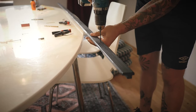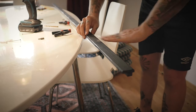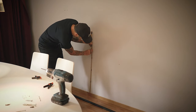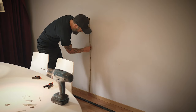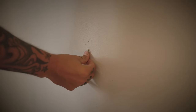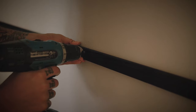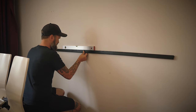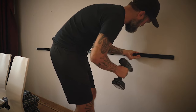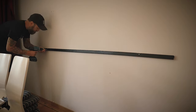When the paint was dry I drilled three holes in each shelf, then I measured out at what height I wanted the first row to start on the wall and marked out the middle of the first one to make it easy to mount. Since we have plaster walls I drilled the hole and put a plug in it, then put the first shelf loosely in place. With the help of a level I made sure it was straight, then I marked out where the two other holes were going to be and did the same thing — drilled holes and plugged it.